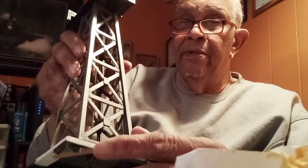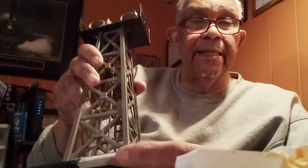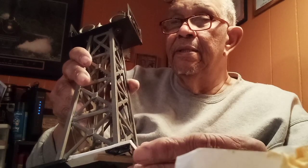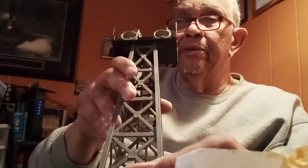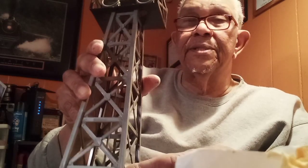And all this section here, this whole corner was missing. And I had a couple of black pieces of plastic. I still have a little bit. And I made the foot for the corners. And then went back and filled this all in with cut strips of styrene. And it's three thicknesses thick. It took, of this particular styrene that I have, three layers in order to rebuild this.